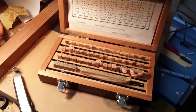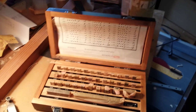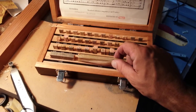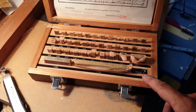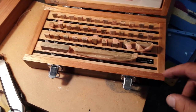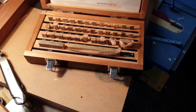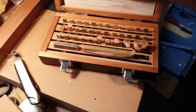Finally bought a set of gauge blocks. I also bought a little three-inch sine bar — it was cheap, like five bucks maybe, a year ago or more. Anyway, I don't really know what the quality is on these. Supposedly it's Grade B, and I think it's a 36-piece set. It doesn't have any wear blocks — normally these come with an extra block to go on the outside faces so you don't wear your measuring ones.